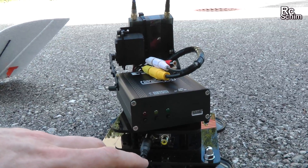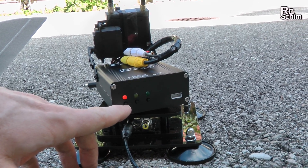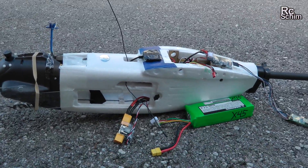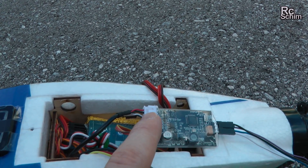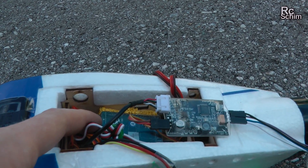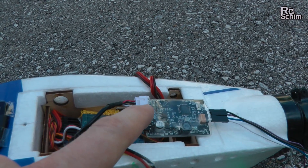We're now turned on but have a slow red blinking that tells us we have no GPS, no video, and no audio at the moment — because on the other side here I have the plane. This is the airborne module. The airborne module gets GPS from here; normally you would feed the GPS signal into the ArcBird and have only the white cable split and feed it here.